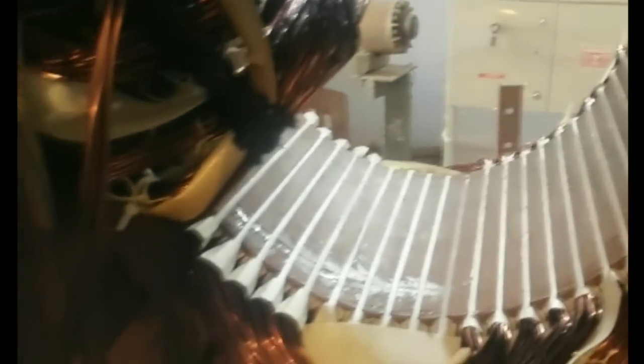From this side you can see all the insulation materials being used. We have leads which are very long — all the way to the terminal. The terminal is on this side and the coils close on this side, so all the leads have to go all the way to the terminal. There are no internal jumps; all the jumps are done on the terminal side and all the leads go outside the alternator. The winding has taken about two days to complete this much and we still have another four more hours of work.